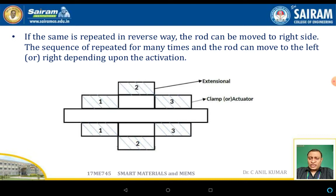The schematic diagram shows three pieces of ceramic materials along with the shaft. One and two are the clamp actuators, and two is the extensional one. To clarify: the first and third are the clamps, and the second is the extensional actuator. One and three hold and release the shaft depending on the direction of motion, while two produces linear extension — either to the right or left — depending on the application, or even in continuous motion.